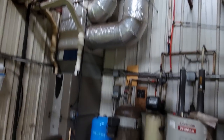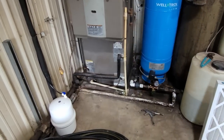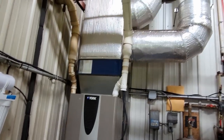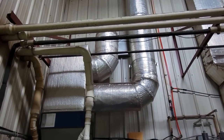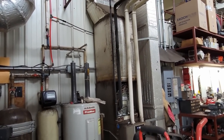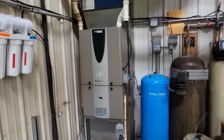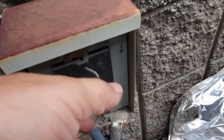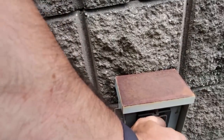I'm doing a little more investigating. This unit over here makes no sense as to why the return air went way up there. I just now noticed this is a counterflow, which means it's either going to go down through the concrete - most likely the first floor. I still don't understand why they're pulling return air way up there. Sounds like the upstairs unit's low on charge; the first story probably doesn't even run. Let me pop that thing open and look inside - see why it's not running. The disconnect looks like it might be a little bit out.